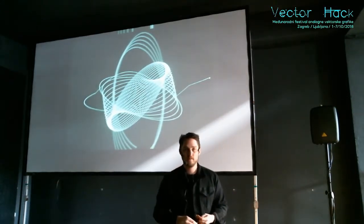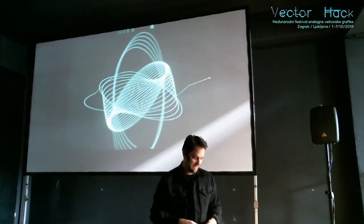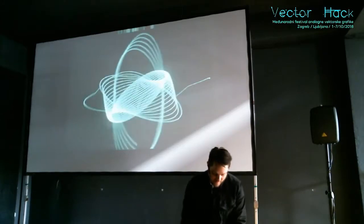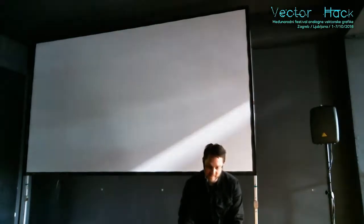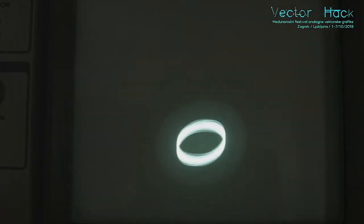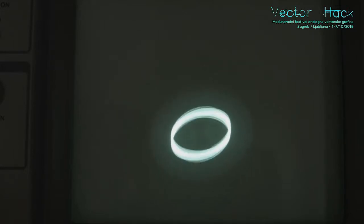Can you remove the sync and show what it looks like? I can. Show us without the sync. It'll look bad. It's blanked, so I need to get rid of blanking. It's a circle. Because there's nothing making it create these interlocking beat frequencies. It's just free running signals.